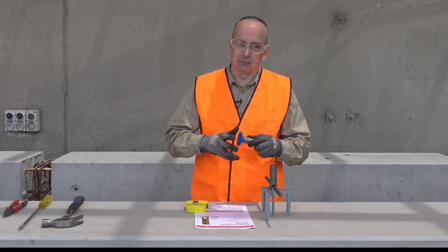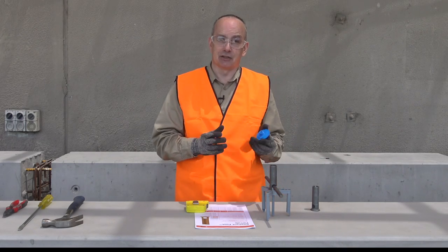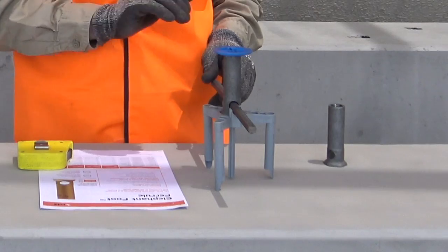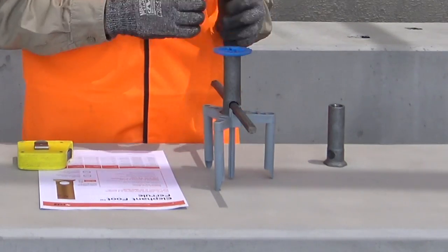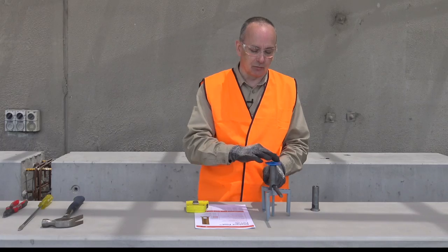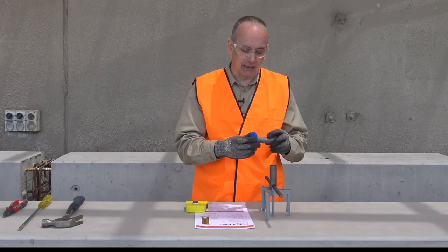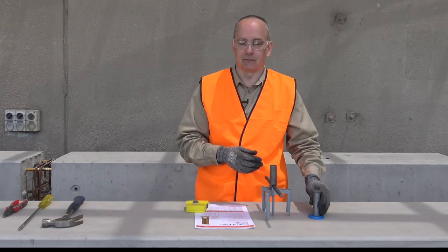Both the nailing plate and the glue plate can be used in addition to a typical antenna cap in the top of the ferrule for near face applications with the ferrule mounted in a chair. For side form applications, the installation is very similar to far face — engage the ferrule in the plate and the plate gets fixed to the side form and/or base form.